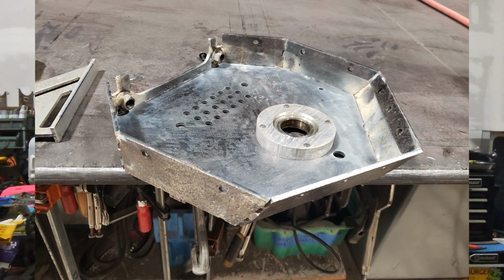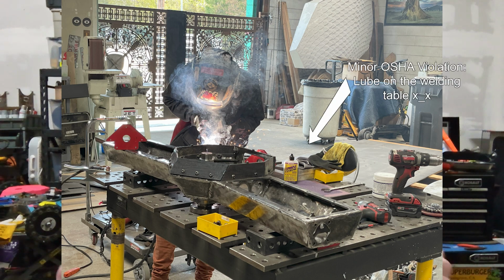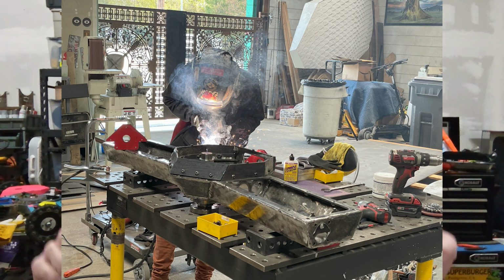For Season 6 and 7, the head is a unibody. Top, side plates, they're welded together in situ at the same time the upper central frame rails are welded onto the chassis. They absolutely must conform to each other for two reasons. One, any amount of interference means the head doesn't slide on very well, and two, any amount of slop is an area where a load, like energy from a hit, could slap the plates together or pull them apart. It's dangerous to leave things loose around the weapon.